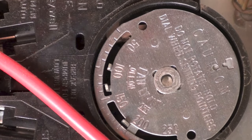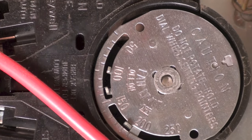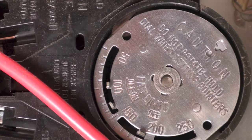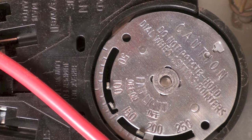To summarize: we should be about 30 degrees different on our temperatures for on and off. I wouldn't put it below about 100 degrees for off — if you go below 100 degrees it'll stay on all the time, especially in the summer. Be sure and keep those things well separated. When you install one of these, be sure you check that the limit works, and run the fan cycle up and down a couple of times to make sure it works. Also be sure that the fan does not start up after it's shut off — when the cycle is off, there should not be enough heat in the heat exchanger for it to come back on again. And that's it for the fan and limit.